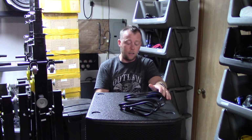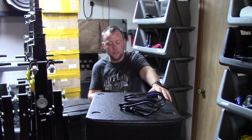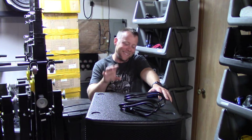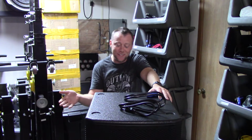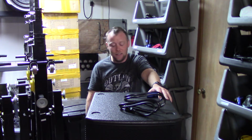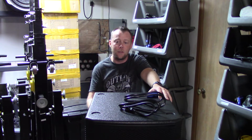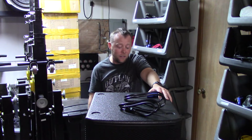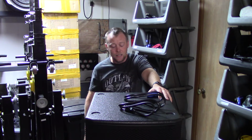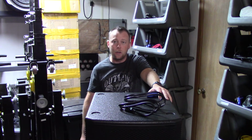Other things to touch on, there really are a lot of options in the menu. Most of them I will probably never use. I do like the fact that you can save presets. So if you use this subwoofer with a few different setups, which, as I said earlier, it's really only good with IQ stuff. But say I did use it with my IP500s, I can have an IP500 setup and I don't have to dial it in every time, it'll just load the presets. If I had my IP300 that I wanted to get, I'd just load my IP300. Say I brought it out with my DAS 12 inches, my crossover, my EQ, however I like to have it set with each different set of speakers, I just load up the preset and I'm good to go.